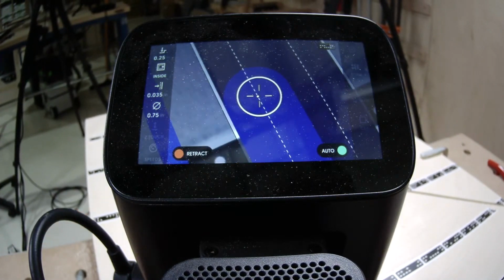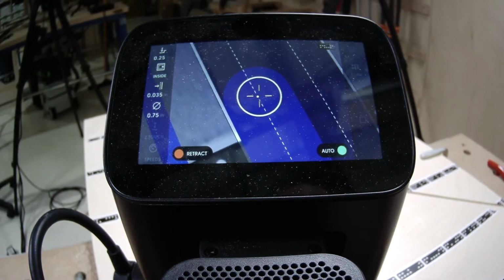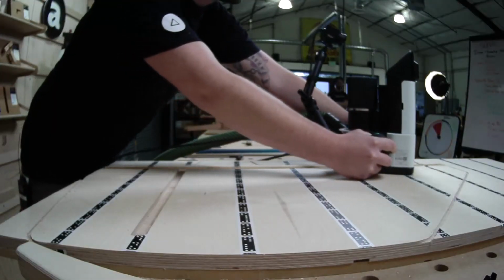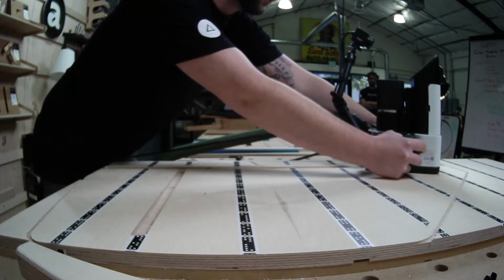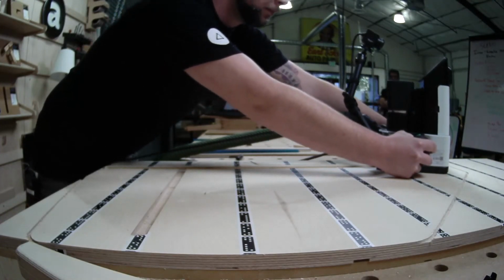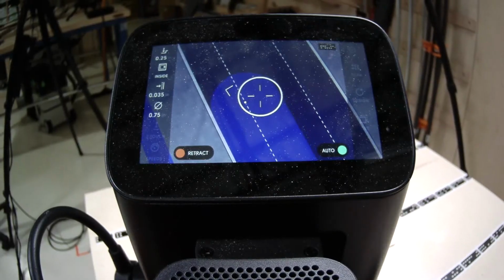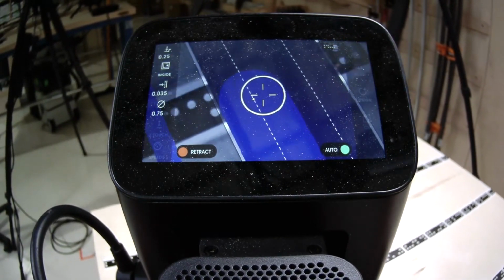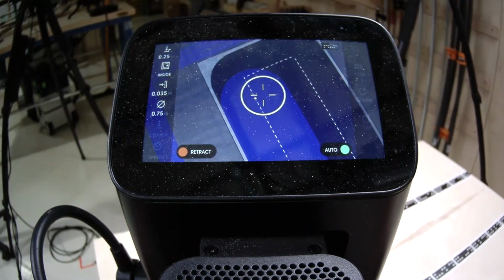Typically here, you could have malleted or hammered that all together, but typically here we go for the squeaky fit. A fit that can be assembled by hand, but that stays together when you take your hands off it. So we'll see how close we get to that. Seems like we're really just sneaking right up on this one.